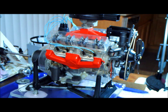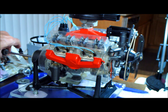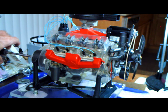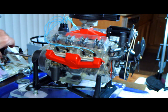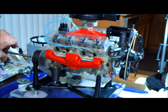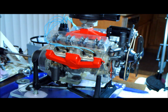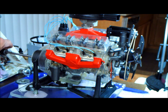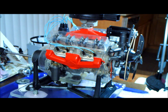You should see the lubrication coming down into the pan from the rods and the crankshaft. It turns in the counterclockwise position from the rear. When this first starts up it's going to rattle quite a bit because the cylinders and pistons are dry. We're running about 14 and a half pounds right now, and today's lubricant is glycerin, which has been working very well. Everything turns and you can see in the video we're getting a little bit of oil flow down there.